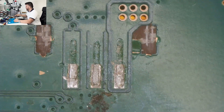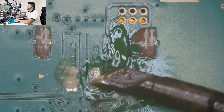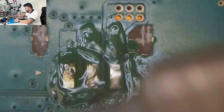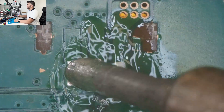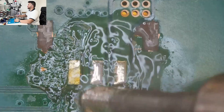Let's put some flux under here and see what's going on — we'll heat it up and try to repair it. The pads are right here, so it doesn't look like it damaged anything. These connectors look okay to me. I just switched irons — this one has a bigger head so it'll heat up a lot quicker. We'll clean this up with our soldering wick to make sure there's nothing left over.